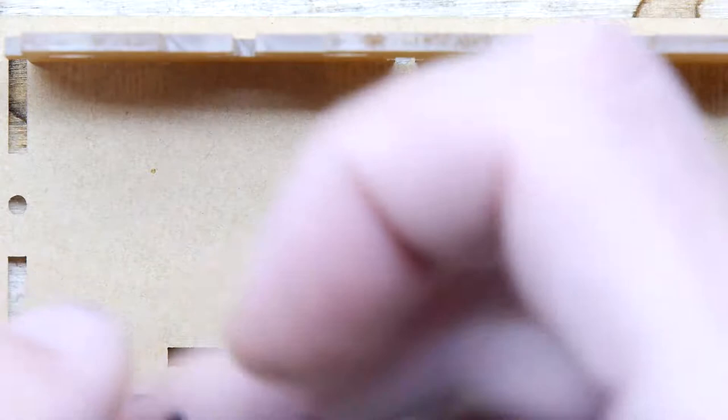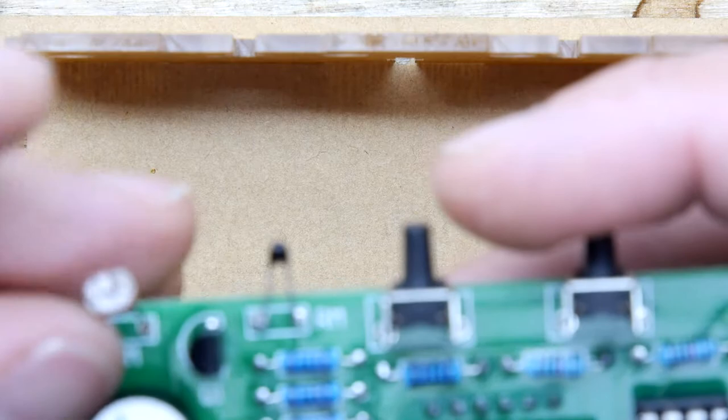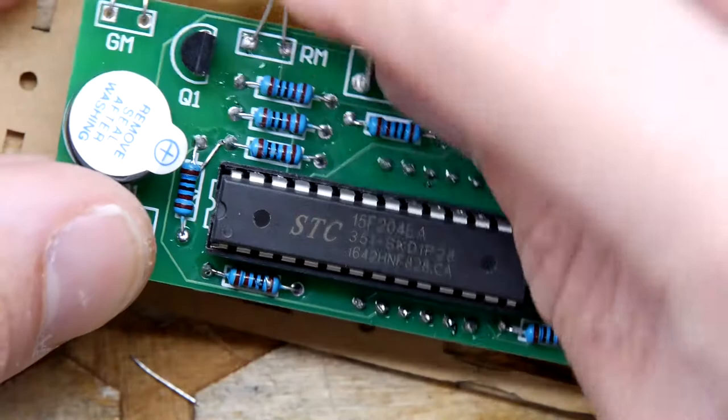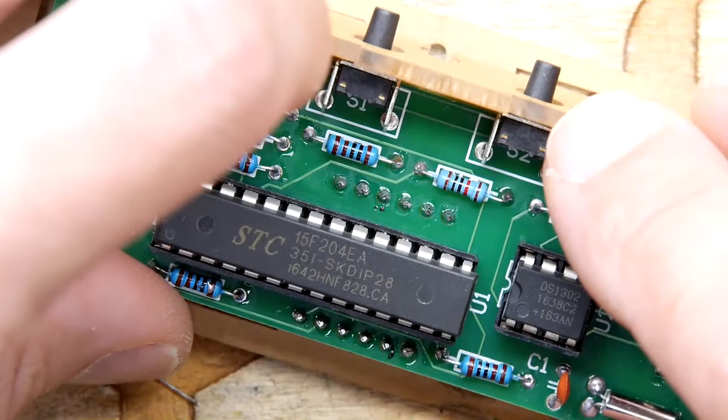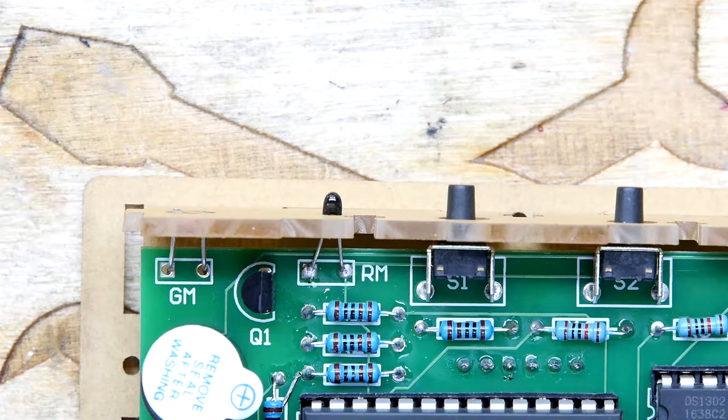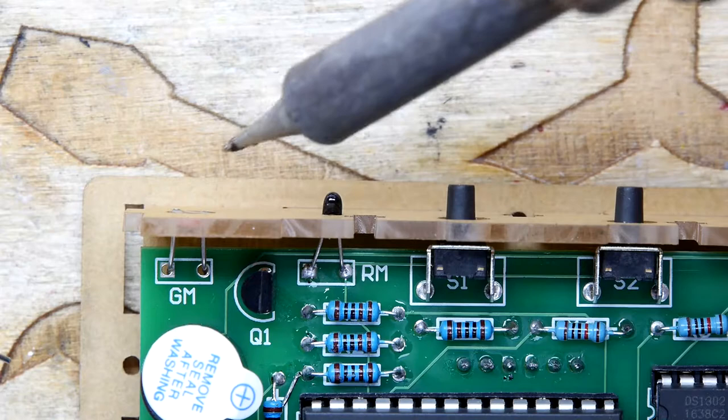Boom, that's back in. Let's get our sensor in, the light sensor. These do not have a polarity, so you're good to go whichever way you want. Now, I thought the temperature thing was a bit high, but it's fine. The higher the better, really, on temperature, but the light thing doesn't have to protrude too much. I don't really want it to, so I'm going to take a little bit more care when I lock that in. There we go, he's locked in. And look, that's just probably about surface mount. Good. Same trickery. I'm not going to tilt it because it will decombobulate, but you can see that it's not protruding out of the acrylic at either end.